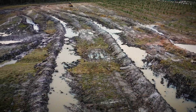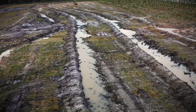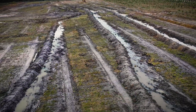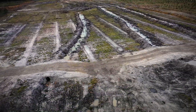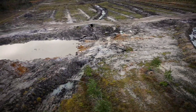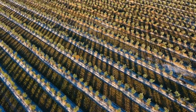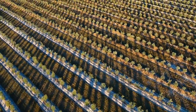The first step for us on this project was to determine our points of water entry, which were the erosion gullies. We used a transit, set up at the highest point of entry that we felt comfortable holding water at. This project had a very specific constraint: we can't hold water as high as we'd want to because of the olive trees. Olive trees don't like standing water, so I would have liked to hold water as high up in the catchment as possible, but because there are olive trees on this specific part of the property, there wasn't much we could do.